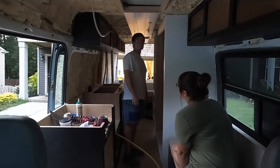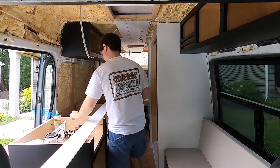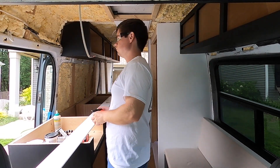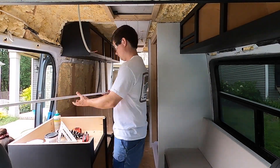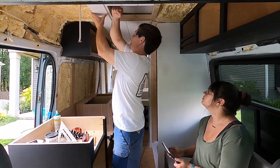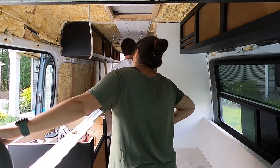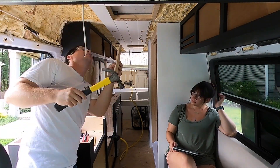We're mounting all of our lights in the shiplap, and we had the wires pulled through conduit in our ceiling already — that's the white stuff hanging down. We wanted lights evenly spaced, so we made them go in the middle of certain pieces of shiplap. We just took a hole saw the right size for our lights and sawed through the middle of the board. As we were putting new pieces up, we'd measure the distance for the light, mark it, and drill the hole so that paired lights always match because they're measured from the same point.